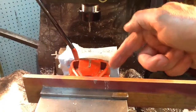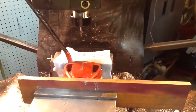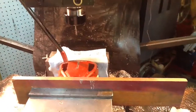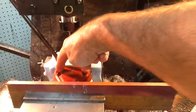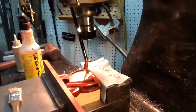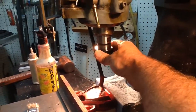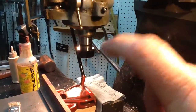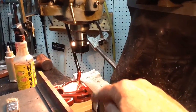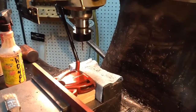So I used the digital readout, I used the wiggler to center it, the markings carefully in between here so that the lineup lines are directly on the head. So it came out pretty good. I used a little 1/8 inch end mill. I had to use this ER collet chuck to give me a little extra depth because the hosel of the putter, I guess that's what you call it, is kind of in the way.